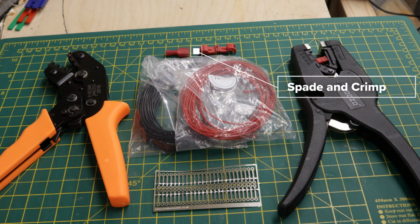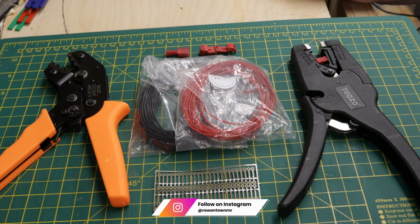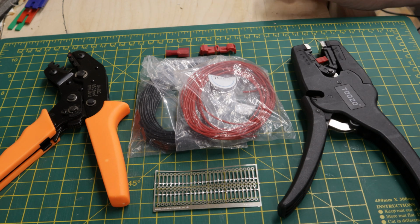Now, to eliminate that, you do a few things. The main thing is wire up track droppers for each and every piece of track that you have on your layout, and that's exactly what I've done. My layout does have some insulating joints in certain places if I want to run block detection, and mainly for the electrofrogs. But this is what I'm currently using on my layout.